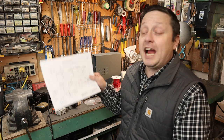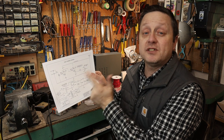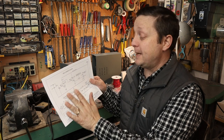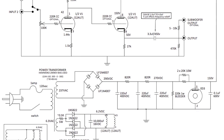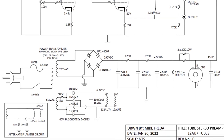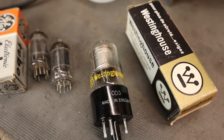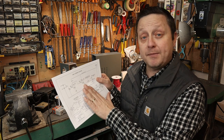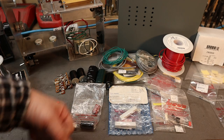I redid the schematic to show the 12AU7 tube - it has a slightly different pin layout and resistor values than the 6SN7 tube, so you have to pay attention, but basically the topology is exactly the same. This amplifier design has been around for a long time - a copy of this was in the RCA receiving manuals. The only thing we're doing a little bit differently is installing an OD3 tube, which is a 150-volt regulator tube. Hopefully it makes the amplifier a little more linear and gives it a blacker soundstage. I'll put a link in the description for the schematic, layout, and parts list.